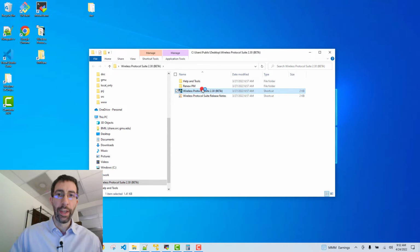So the next step is to talk to the Bluetooth controllers via the Linux tool Bluetooth CTL. So we load those. I select the first controller, and if you look over here, you don't see any traffic yet because the Linux hasn't actually started talking with the controller. So I'm going to select which one is the server, and I've given it the name GATT server. And then I'm going to go to the GATT menu.